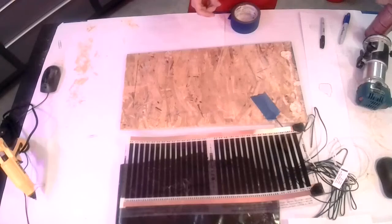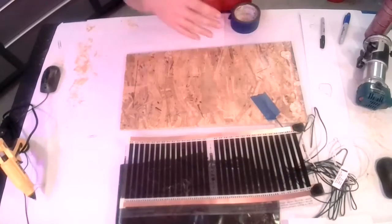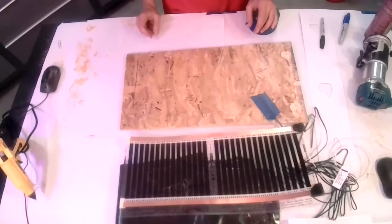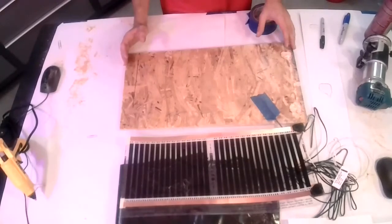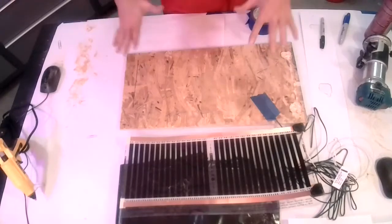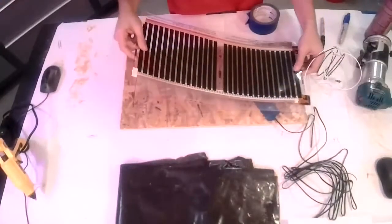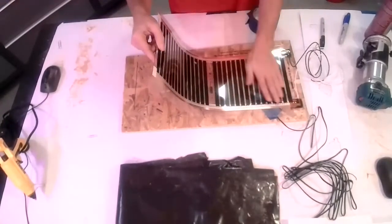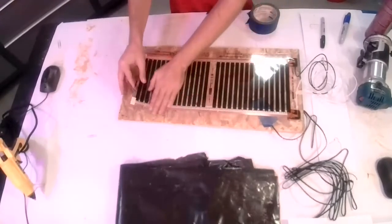Depending on your spray adhesive, sometimes it's stuff where you need to let it tack up first. Other stuff you double coat and do both sides. Just follow the installation instructions. But the main thing is you're holding the panels down. They're not going to shift around, especially if you have a floating floor over the top. For the most part, the flooring will hold the mat in place pretty well. So it doesn't have to be a perfect glue job, but the better you can do, the better. The less it'll fight you, I guess, is the better way to put that.